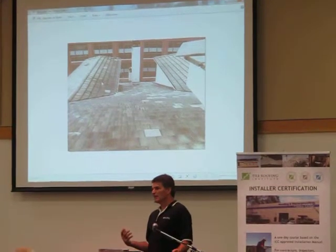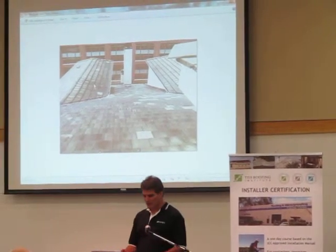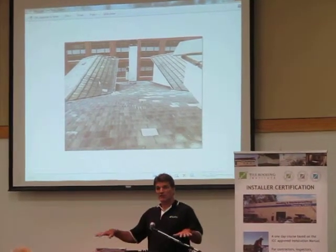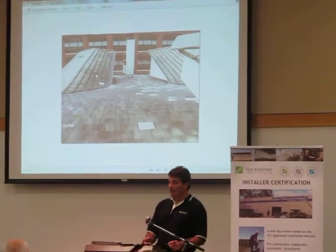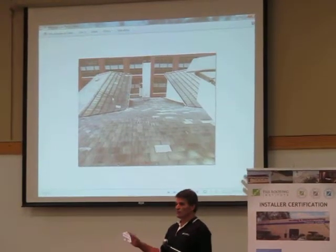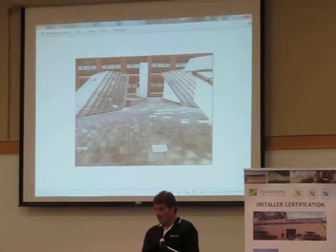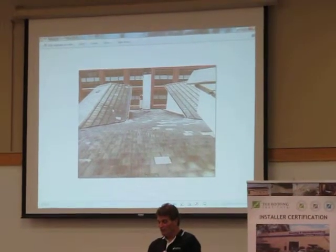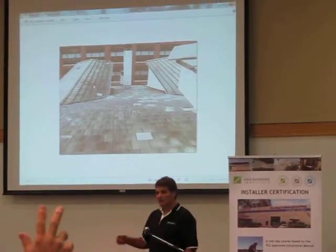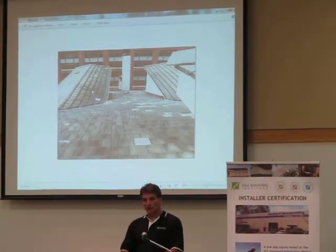You've already got a big run — a normal home might have a ridge run of 16 to 18 feet for a three-bedroom, two-bath house. When you have 52 feet, you've got a lot of water running down the roof by the time you reach the bottom. Now add 12 dormers on each side of the building that are focusing that water, with no downspouts at the time to pick it up. That area below the chimney is getting three or four times the normal amount of water.